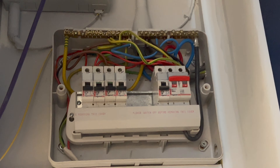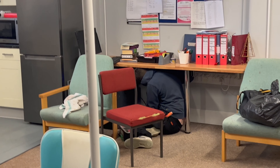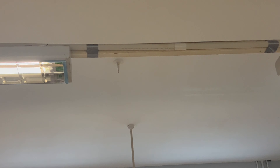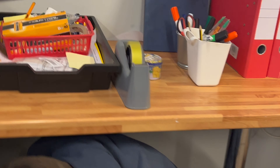That's all turned off — that's the board we're testing. It does the kitchen sockets, the dados where Ebzy is, and then we've found this nice little find as well — an extension lead plugged in permanently. It's been cable-routed across the lighting trunking, gaffer-taped up there, and comes down as a permanently placed extension lead. That's no good — mainly we're concerned about premature cable collapse in the event of fire.